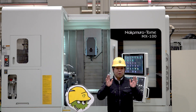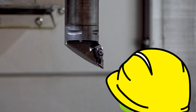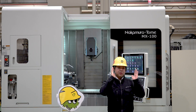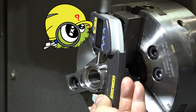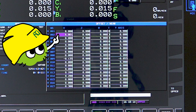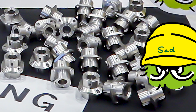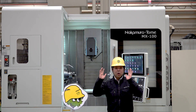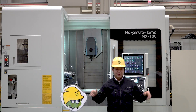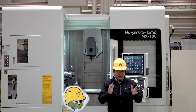I understood. From now on with OneTouch production, there is no need to worry. After changing an insert or a corner, there are steps like inputting a bigger offset, semi-finish, measure, and adding the new correction to the offset and finishing the process. But with OneTouch production, the machine will automatically take care of all these steps for you. Now, let's see how it's done in practice.